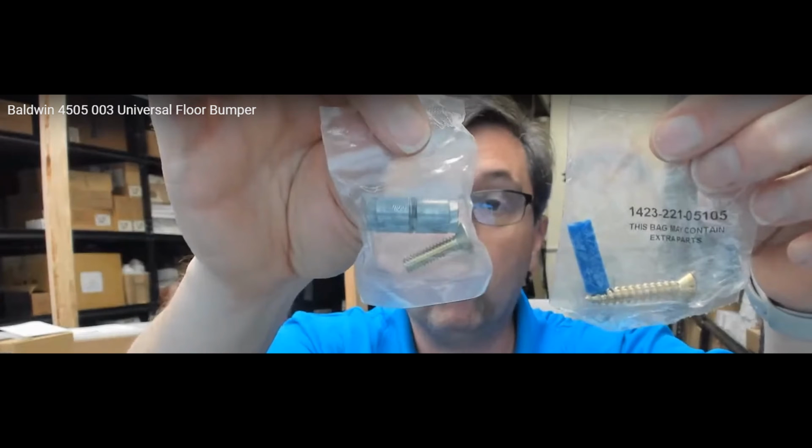But what you've got there is basically two packages. On the left side, you've got a machine screw that's going to go into that double expansion anchor. That's for masonry. Way too long to fit into your application. On the right side, you have a threaded to the head wood screw or a sheet metal screw. That can go into wood, but if you add that plastic anchor it will allow you to get into masonry or anything other than wood. If it was me, I would be using the double expansion anchor all day long. It's either the double expansion anchor or that wood screw.